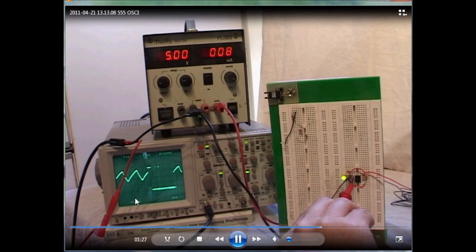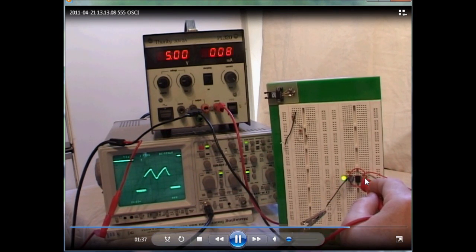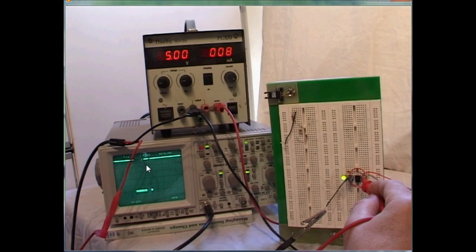On pin 2 you should get the same measurement on pin 6, as they should be connected together in this configuration. I'm also checking the power on pin 4 — it's a flat 5 volts — and the power on pin 8 is also a flat 5 volts. All of those tests go together to make sure that this particular circuit is working. Hope it's helped, goodbye, good luck, see you next time.